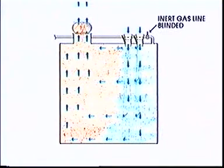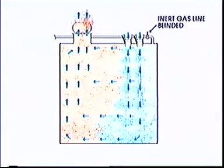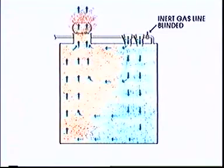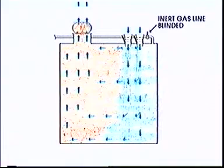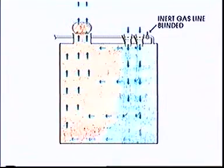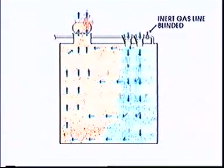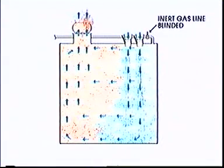Before you ventilate a cargo tank with fresh air, its IG line must be blinded to prevent inert gas from sneaking back into the tank. There are two water-driven ventilators on board this vessel. Each has a capacity of 10,000 cubic meters an hour. Both ventilators are placed in the forward part of cargo tank number one. Open the trunk and the Butterworth hatches in the aft part for maximum ventilation. As a rule of thumb, the atmosphere of the tank has to be changed approximately 3 times to free it from gas.